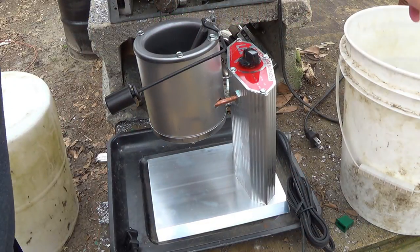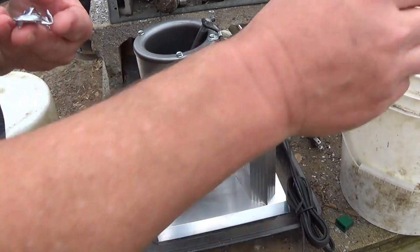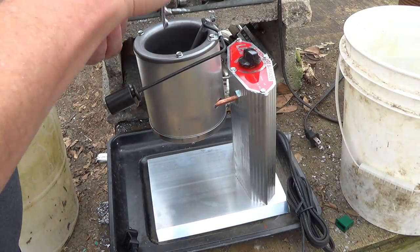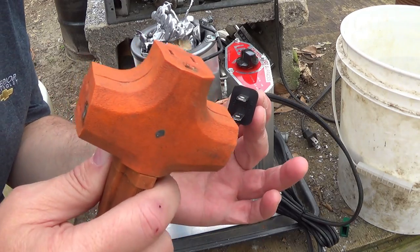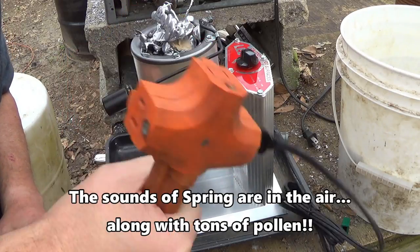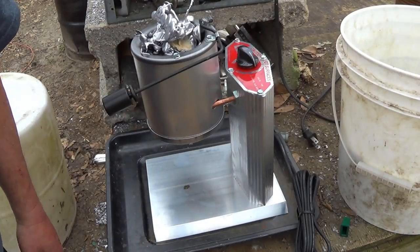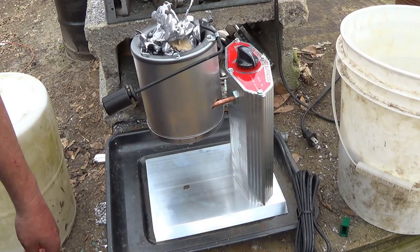When I fire up the new pot for the first time, folks, I like going back with sprue or range lead or a combination of all of it, because it's small and it gets down in the pot real easy. I keep mine between 7 and 8. Alloy needs to be screaming hot. All right, we'll see how the new pot does, and I'll get back with you.